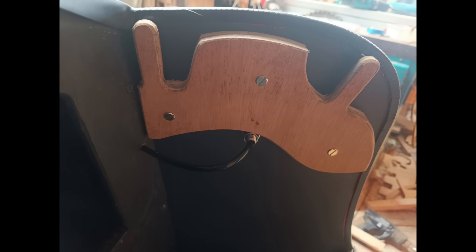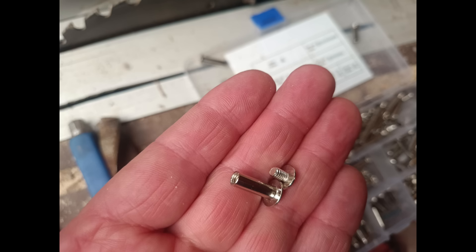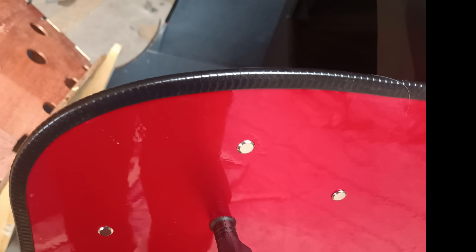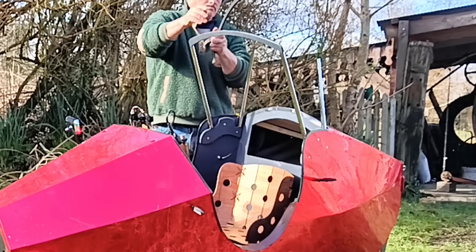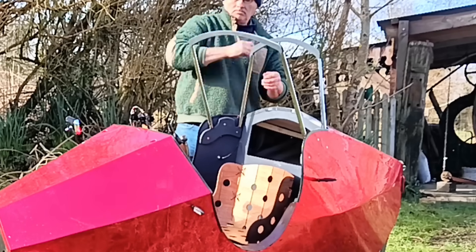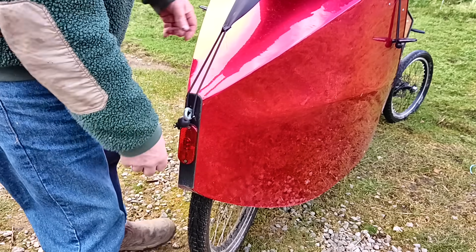After a lot of experimentation with pipe lengths and angles, I settled on these wooden brackets that are permanently attached to the wings. And I used these double-ended chrome bolts for neatness, at the top of the windscreen as well. So the two frames just sort of slot together and slot onto the roof support bracket — that's easy. And the fabric goes over the top and down to the back with a bungee to hold it taut.